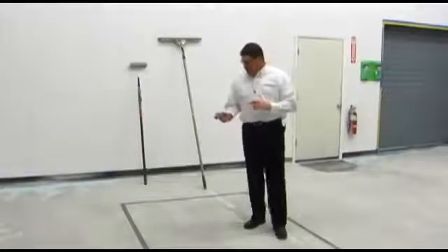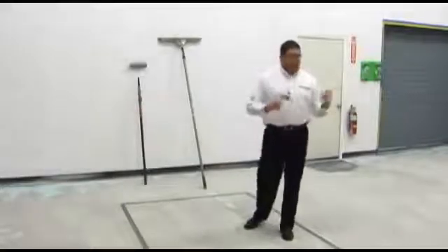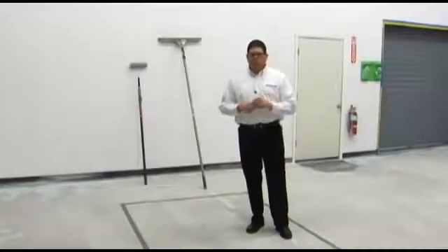Today in here, we have a substrate temperature of 63 degrees. Our ambient air temperature is probably 65 in here. So we're good on our scales to be able to install the product.